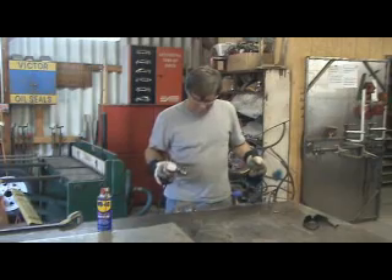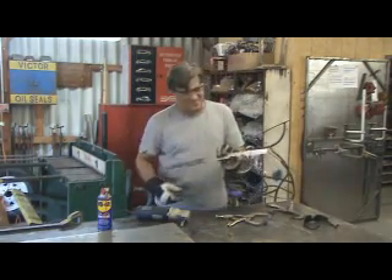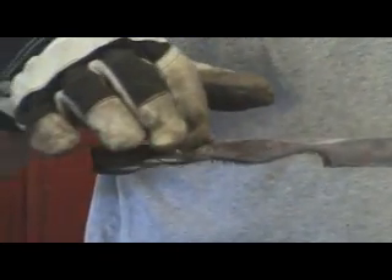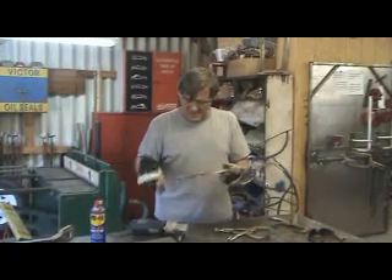Here's the finished product — well, not quite finished. Here's where the plasma cutter cut and you can see the heat distortion and the burning on there. And here's where the nibbler cut — no difference in the color of the steel at all. If you turn it over and look at the back side, the nibbler side is all nice and smooth, but the plasma side is all jagged, so I'd have to come back and grind the slag off and trace along the edge to get right on the line. With the nibbler you can get a lot closer. It all depends on which piece of metal you're working with and whether you have this tool or that tool.